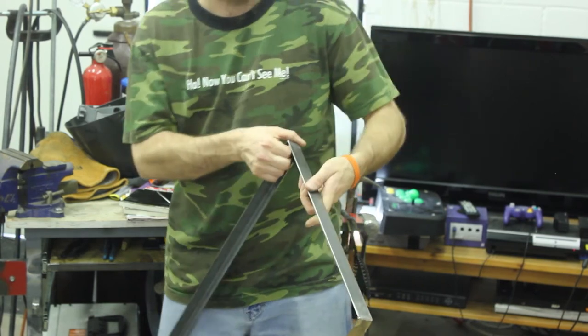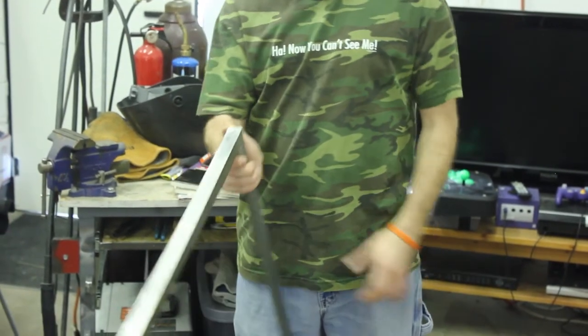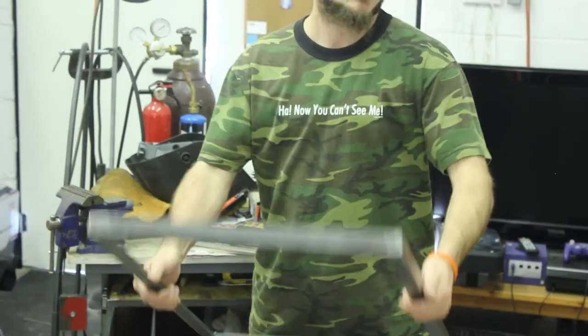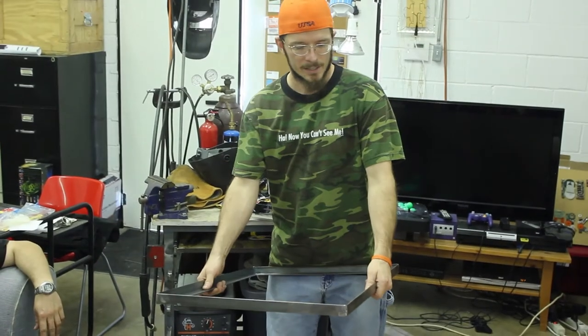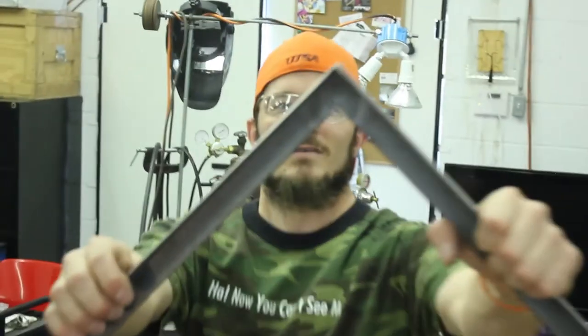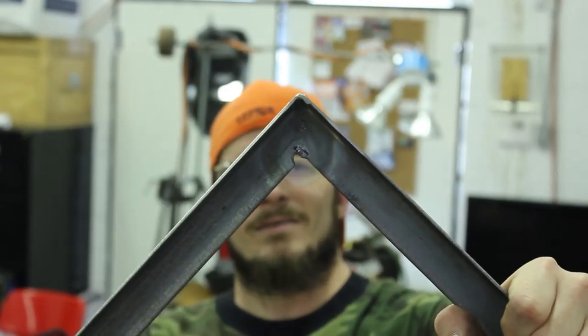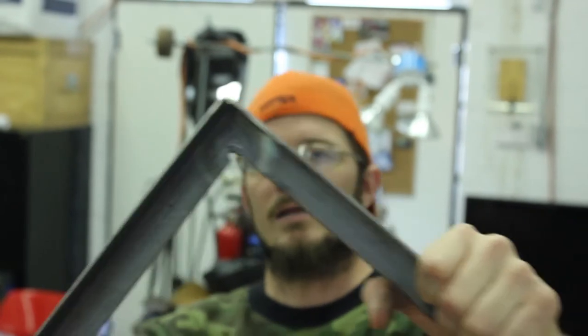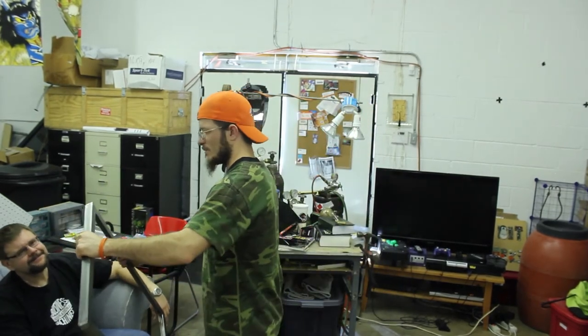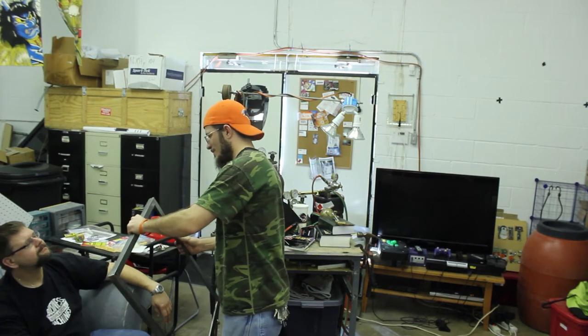You don't need to. I mean, bevel the outside, right? This is a cheap little drawer. I was welding the corners just for the fun of it, just for the experience of it. I went a little bit in and I stopped. Again, here's a blowout, where the weld just got too hot and the metal just kept dripping out, and I felt it a little bit and then I was like, it doesn't matter, and I stopped. You know, whatever, I let it go. So that's a lesson of what not to do. That's a bad weld. Bad hot.